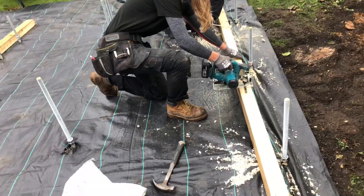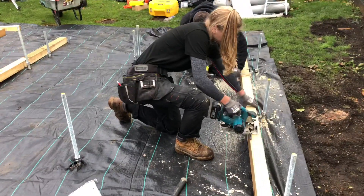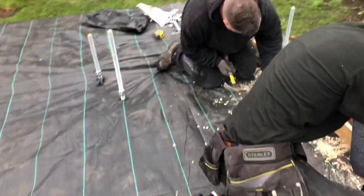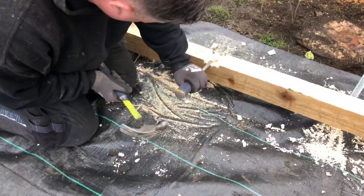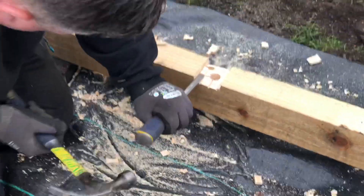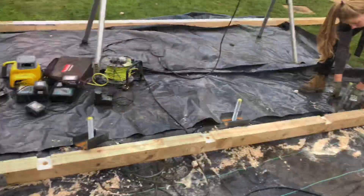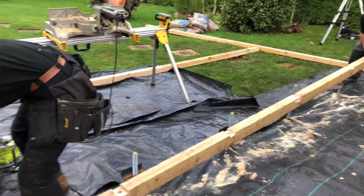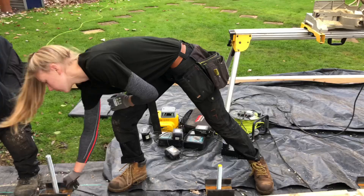What Amy's doing now is checking the depth of the circular saw so that the nut can get deeper into the timber. She's going to chop it out there, so that when you're sitting the nut down it will be level. The nut's locked off, it will support the timber, and you lift the timber to the top and drop it down onto the rods.